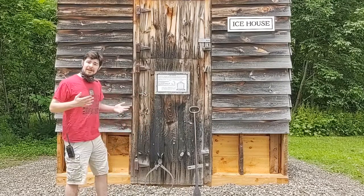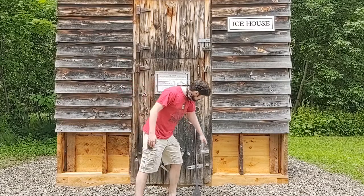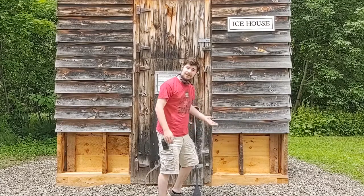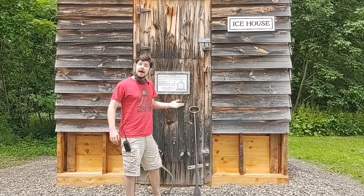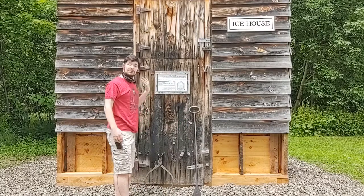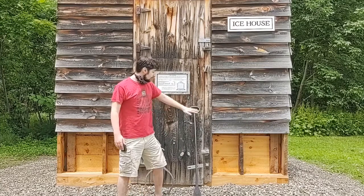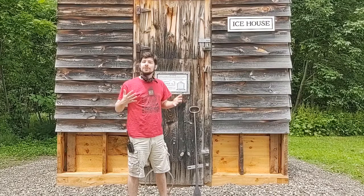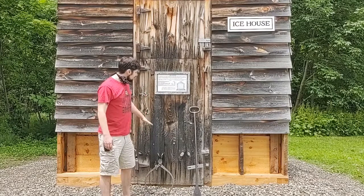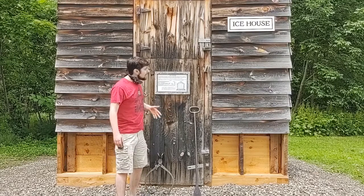At first glance it looks kind of like an ordinary shed. But if you look closely — and we're actually doing some restoration right now — you can see it's got these double walls here. We've got one on the outside, a space, and a wall on the inside. That's done to help keep the air inside cool. It's July right now and we've got the sun beating down on this ice house. There's no ice in it right now, but there usually is. That air in between acts like a cushion — it keeps that hot air out and keeps the air inside cooler. We also have drains in the floor and vents in the ceiling that help keep things cool.